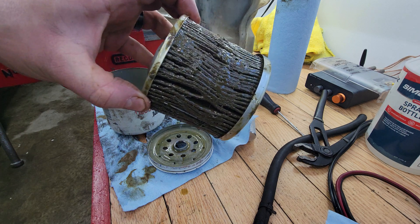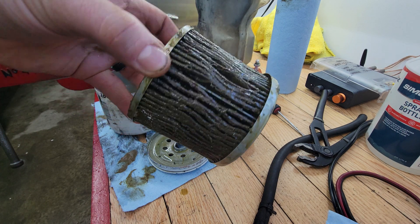There's your proof of why you need a coolant filter in your truck. Most of the time people just run an all-vehicle type of antifreeze in these pickup trucks, and you can for the most part get away with it — I've done it for the past 10 years and had no issues, or at least so I thought. But my recent coolant filter change has led me to do a bit more research rather than just using an all-vehicle antifreeze, and instead use a Cummins-recommended type of antifreeze.